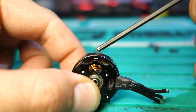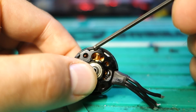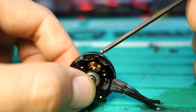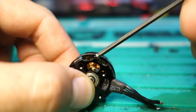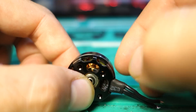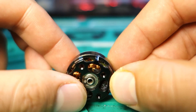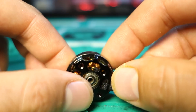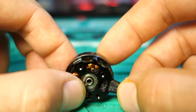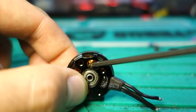It's going to be really hard for you to see, but if you look up inside of the bell, you can see that there are magnets up there. The magnets are what rotate around the outside of the electromagnet to produce the thrust from the motor. Now the magnets in this motor are curved, and like the industry trend, curved magnets actually increase, I believe, the surface area close to the stator, which is the electromagnet on the bottom.